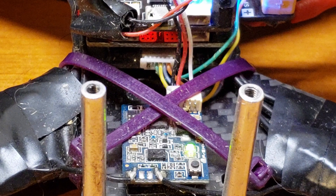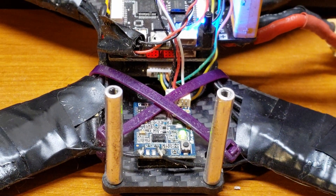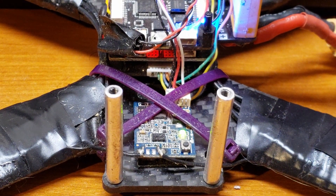That's all it takes — about a two-minute process. This is basically the same process for most FrSky receivers. There's usually some kind of bind button that you push; sometimes it's really small and you need a hex driver to reach it, sometimes it's in an awkward spot and you may need a second person to plug in the battery while you hold the bind button. But this method covers roughly 80 to 90 percent of all FrSky receivers out there.